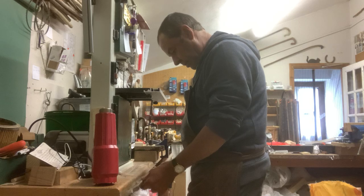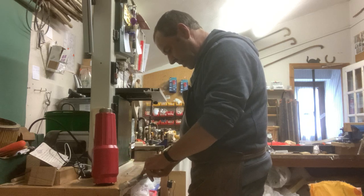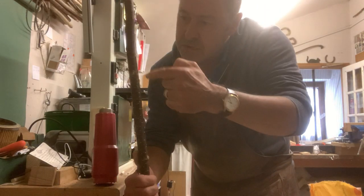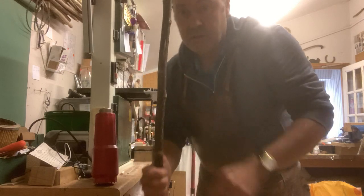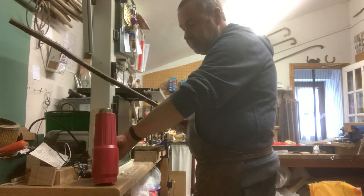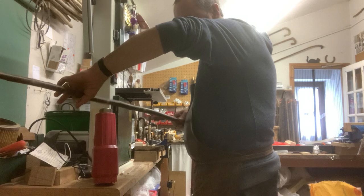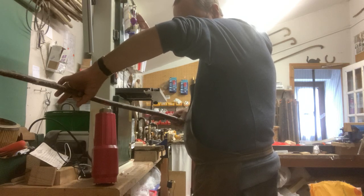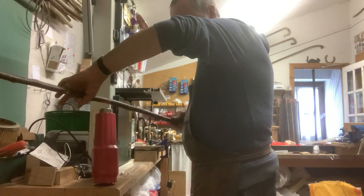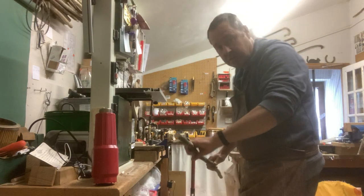Move on to another one — rub that one out so I don't do the same bit twice. Checking on my table, keep rotating it till you find where the biggest bend is. Mark it my side — that's where I'm going to heat it up. Where's my chalk mark? There. I'm going to heat it up, same as before. Hold it above the heat gun, keep it spinning, keep it turning all the time, you don't want to stop it.